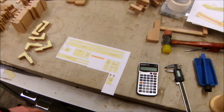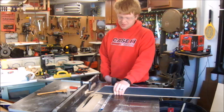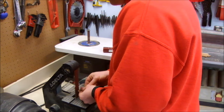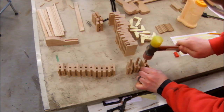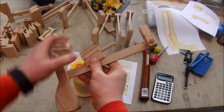Now I'm going to start working on the bolt, starting with the firing pin, which I've taken measurements off the drawing. It's kind of annoying — these dowels are so small that every time I cut one off, the blade grabs it and takes it down the hole. I eventually got all those dowels cut. At the strip sander I'm putting a rounded point on it so that it fits through the hole easier. The pins strike the Jenga blocks so they'll never see tension inside the bolt. A few drops of glue and tapping them in is all it takes — no clamps required. Per the plans, I use the same 5/16ths dowel for the pin as in this joint to strengthen it, so that when this whacks it, it doesn't break off.